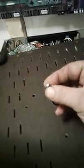Here we are at the bottom of the record player. A little tip: whenever you're working on a record player, be sure to keep the dust cover on top when you flip it upside down. Also make sure you remove the platter and the rubber mat. With this one it's really easy — most of them are all the same, just held onto the bottom with a bunch of Phillips screws.